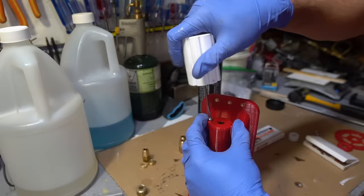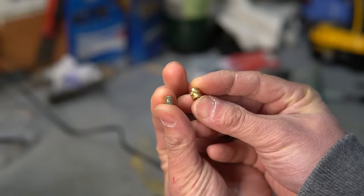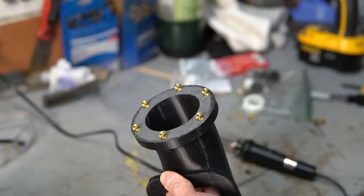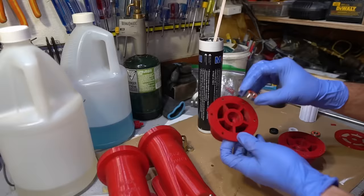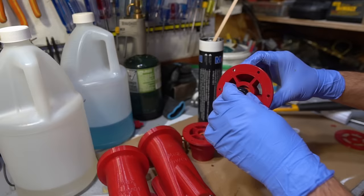On top of the bearing assembly, I capped it with a retaining plate that was screwed into some 4mm hot melt thread inserts. Also, these brass hot melt inserts are used on the rear flange to allow the pump to be mounted. They're installed using a soldering iron. This part is called the diffuser or nozzle and had a bearing and oil seal installed as well.